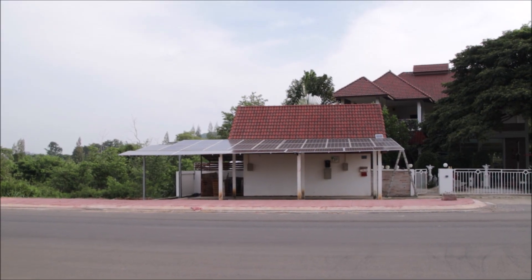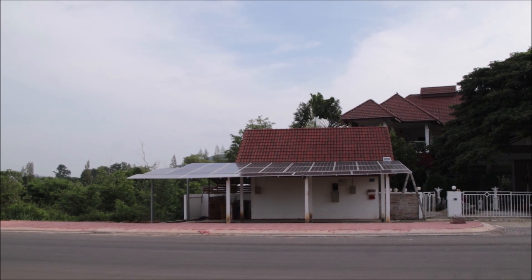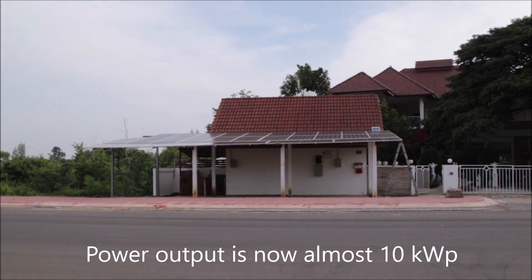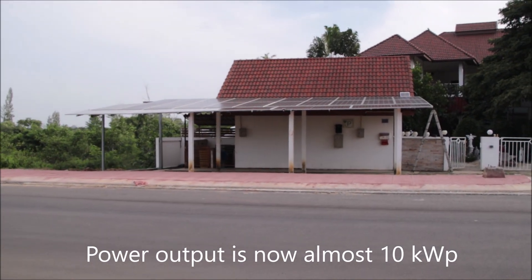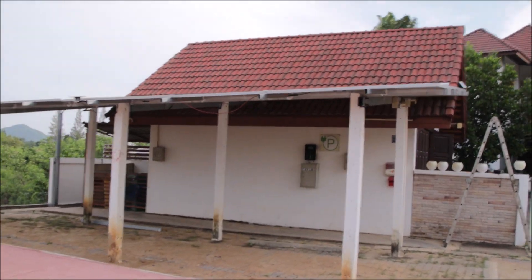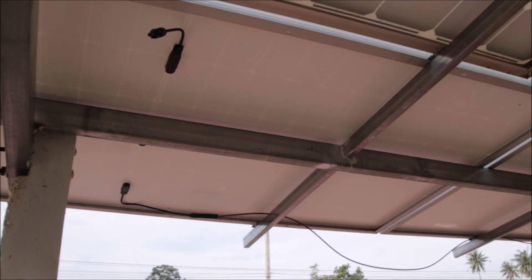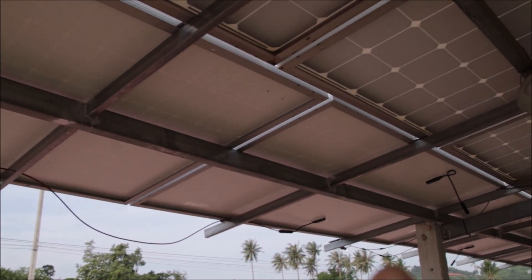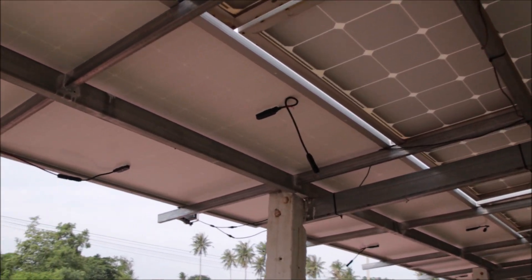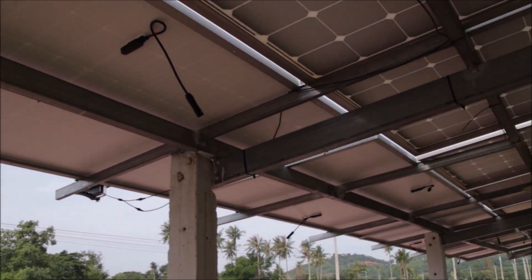It's the next day in the morning. We have again a massively rebuilt, finished PV array at the garage. I installed the panels yesterday — what's missing now is just to connect them. These are half-cell type PV panels, so I have to connect them together from one panel to the next using PV cable and MC4 connectors.